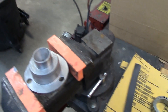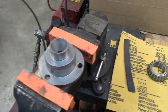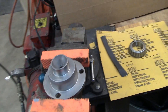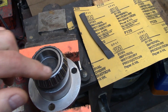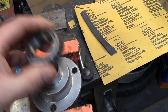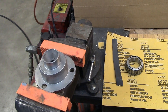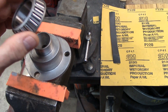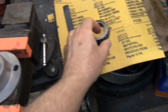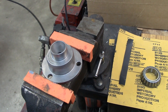There are many ways to install pressed-in or pressed-on bearings. You can use a hydraulic press if you have the right diameter tool to go around without pushing on the cage. You can use an arbor press — I don't think these are a really tight press fit. You can use a hammer and a bearing tool and beat them on. Another way is to heat up the bearing so it just slips on, and there are many ways to do that.